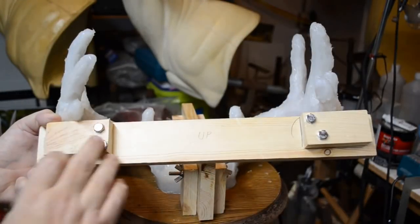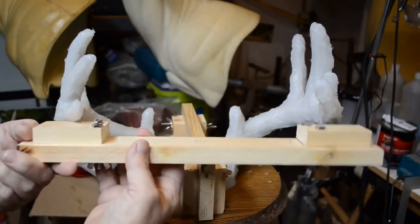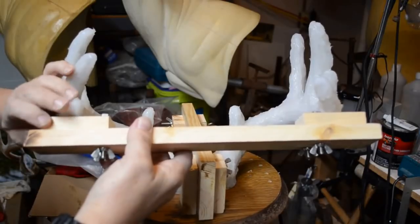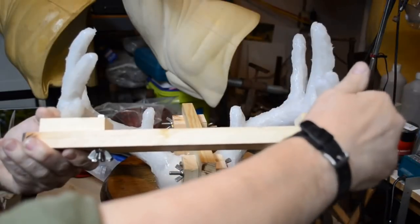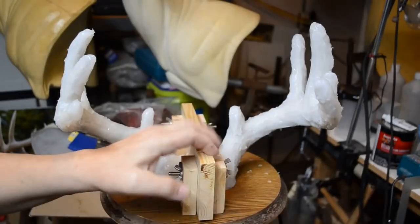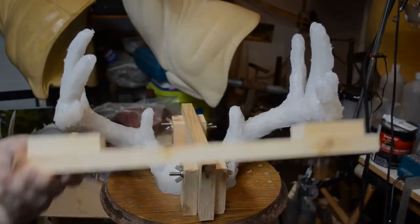Okay, we have the spanner ripped down, like I said, with the little elevator braces bolted into place, and they attach like so. And this will be glassed onto around the outside. The Bondo glass will come into contact and connect here with just this piece alone, and here with just this top piece alone. But there we have it. And it's better that I ripped this on my table saw, because it was banging into the centerboard. Now it's not touching it. Now there's plenty of room there. It's no longer making contact. So it's in good shape.